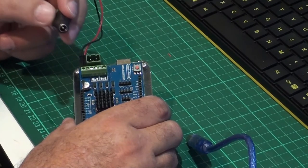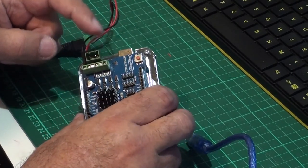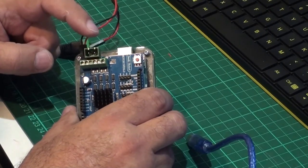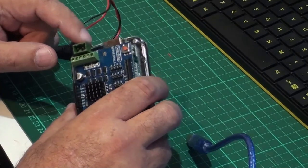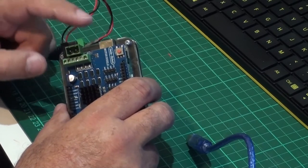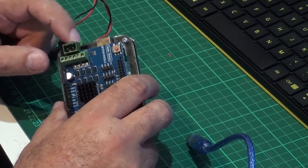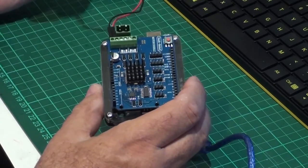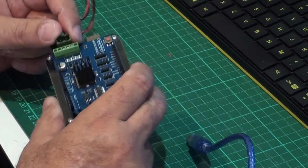15 to 18 volts maximum, minimum 12 volts. I put a little connector on here because I find it easier to connect to my test track. The first two outputs are for the track — labelled A or 1. The second two, known as B or 2, are always for the programming track. If you don't have a programming track, that's fine — you can actually program on the main line. That's how you set it up. It's just a matter of connecting A and B to your track and away you go.